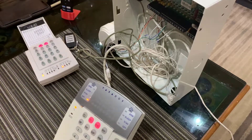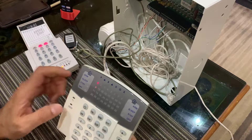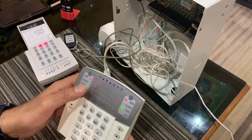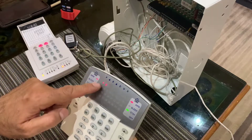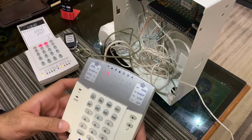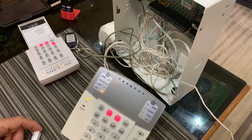If I need to do zone 2, which is the motion detector, I do the same thing — I hold down that button. Now I see zone 1. If I want to disable zone 1 I can enter 0 1, or to enable it back I enter 0 1 again. If I put 0 2, now both zones 1 and 2 will chime when triggered. Once I'm done I press enter. So if I move in front of the motion detector it's going to beep, and if I open the door it's going to beep.